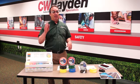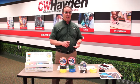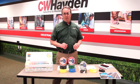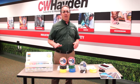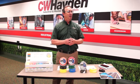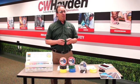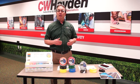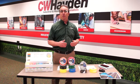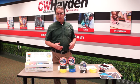Number 4 is standardization. Establish standards and guidelines to maintain a clean workspace. It makes things always run much more smoothly when you can get from point A to point B without walking in a zigzag. Number 5 is sustain. Make 5S a habit. Train others how to use and maintain the established 5S protocols that you have for your company. The benefits of 5S: it makes your workplace more pleasant, improves work efficiency, and it improves safety.